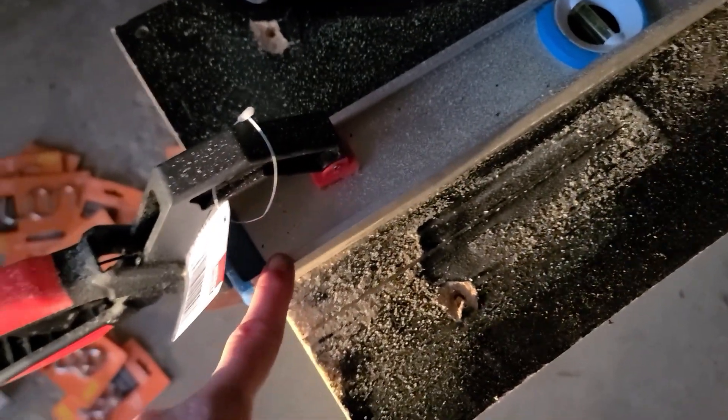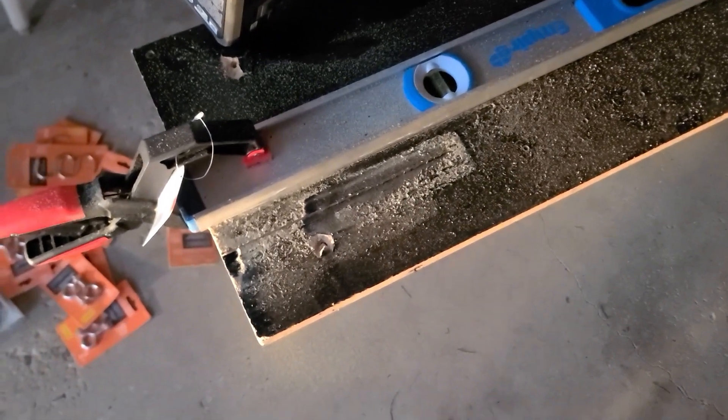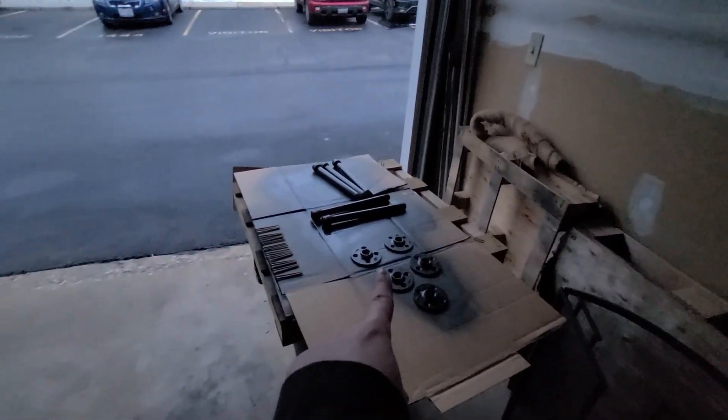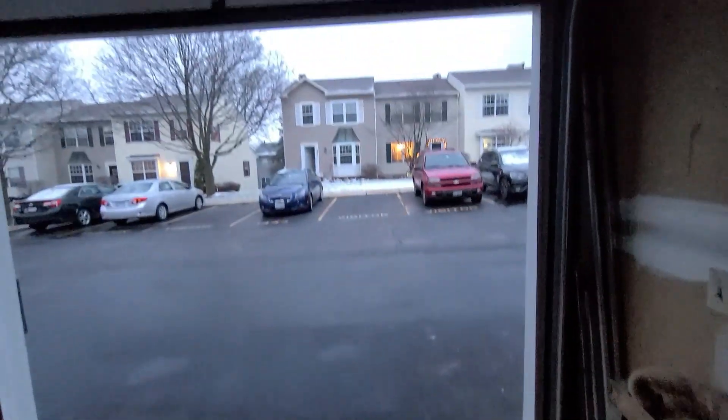We're losing light, so I pulled my car in. I have my level clamped off here so that I can get this cut nice and straight all the way down the board with my skill saw. So I'm going to go ahead and rip this board all the way down, and I'm going to do that on both boards. I measured from the good side eight and a half inches so it can fit on the shelf. I ripped these boards eight and a half inches wide on both of them — this is three feet and this is six feet. My spray painted pieces are all dry now — screws are dry, poles are dry. So I'm going to get those inside and show you what I'm going to do in there.